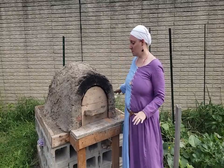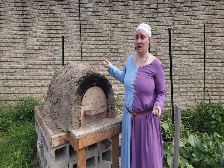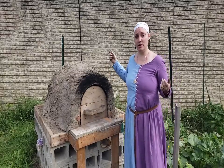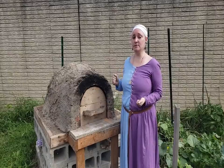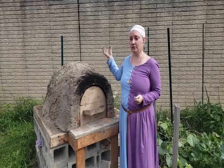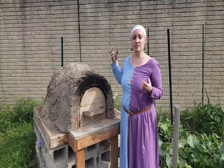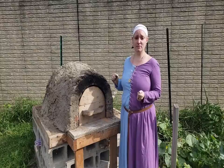You built your platform, built your basket, mudded it, fired it, you're ready to eat. One of the questions I get a lot is, can we use it the same day that we fire it? Yeah, absolutely. It's 100% ready to go. You might not be able to cook on the same fire that you use to fire the oven, though. You might need to rebuild your fire up to retain more heat to be ready to cook. But you can absolutely use it the same day.